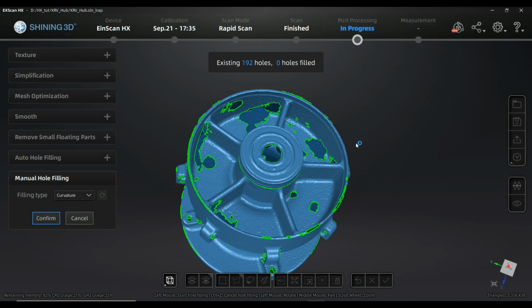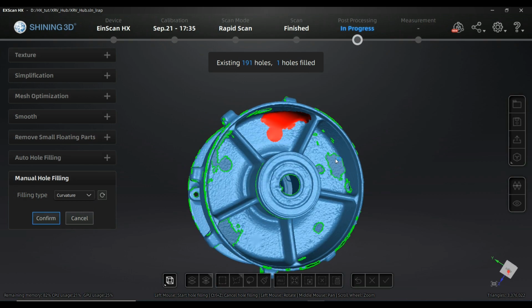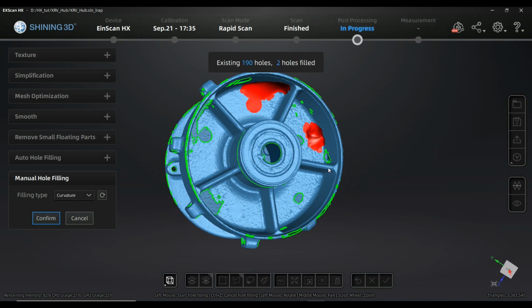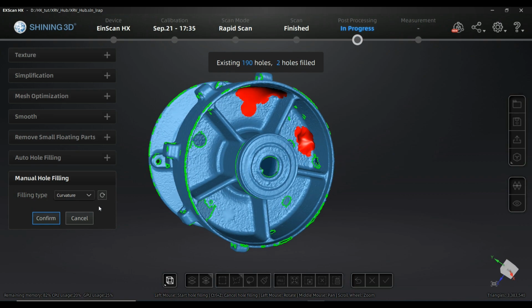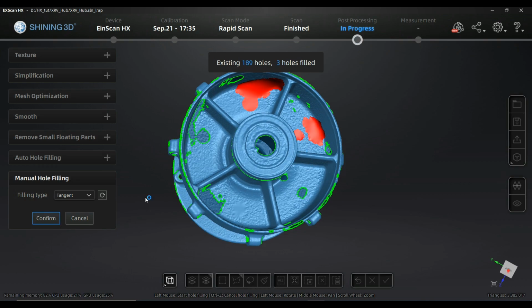That means in polynomials there is a static surface in 2nd degree, and this should follow that original shape much better, and it does actually. What can happen is that in very, let's say, unsteady surfaces like here, because of bended edges or scanning errors, whatever, it can lead to some very unsteady surface, and maybe that's the reason why they are not using it by default. So in this case, if I have that kind of strange behavior, I can go back to tangent or flat to see if it's doing a better job, and it does actually. So this is some kind of trial and error procedure to see what is good there.